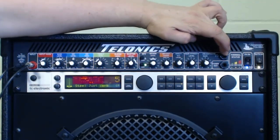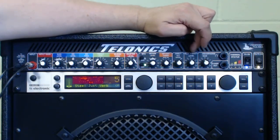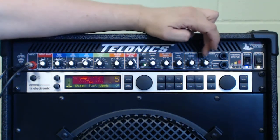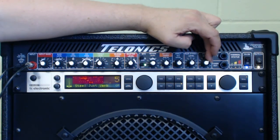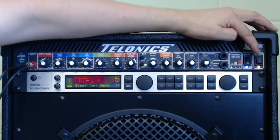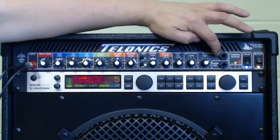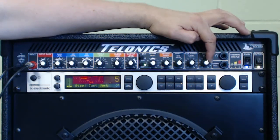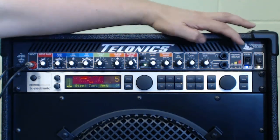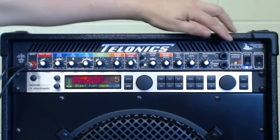You've got a headphone level here and a headphone jack, and a very nice feature is you can set the gain there separately. The mute control — when the LED shows it — mutes the direct output and obviously the speaker, but it doesn't mute the headphones. So on stage you can be warming up playing through your combo, but nothing will come out of the front-of-house and nothing out of this speaker. When the curtain goes up, take out your headphones and you're ready to play.